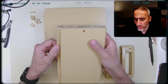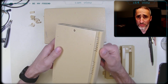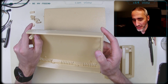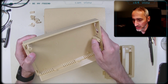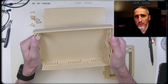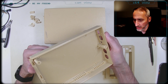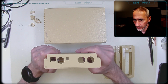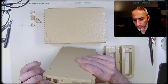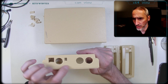And I had to print this with support material, and this hardly comes out beautiful. As we can see, the material has created some stringing as well. So I think the material flow rate for the 0.8 millimeter nozzle isn't perfect, so I may have to adjust this a little bit. And as you can see, printing the back part of the lower part of the case creates some overhang troubles here as well.